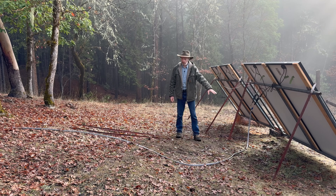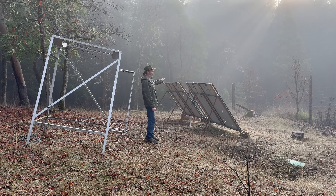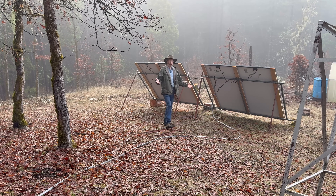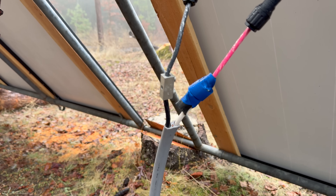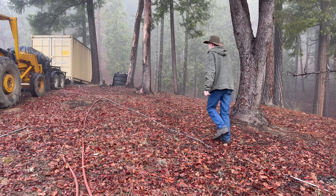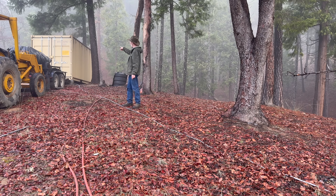For now let's follow this cable up and I'll show you the other end. After you take a look at the rest of it, you can decide if you want to make the commitment to learn about wiring those up. This cable is 6-2 direct burial, meaning you can directly bury it. 6-2 means a six-gauge wire — that's the diameter — and two means there are two of them, which is what we need: one for positive, one for negative. It runs 170 feet all the way to the other end. I haven't buried it yet because I need to move the panels.